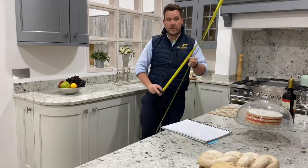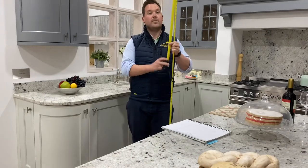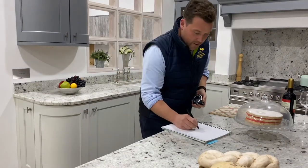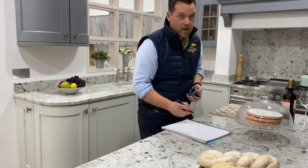So that really is the information we need: external features of doors, windows, and archways in regards to heights of doors, heights of windows, heights from the floor, and also ceiling height. The easiest way to measure ceiling height is to stand on your tape measure and pop it up to the ceiling. I generally write RH in the middle — room height — and in this case it's 2,400. Our ceilings are high, but 2.4 metres is standard ceiling height. Anything lower than 2.2 metres, we need to know about, as it's crucial for standard-height kitchen furniture. Low exposed beams, ceiling wedges where your stairs go down — all that sort of stuff we could do with knowing about. If it's difficult to measure, just take pictures and we can ask the relevant questions.